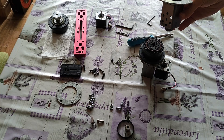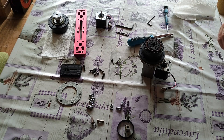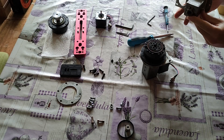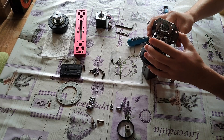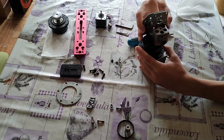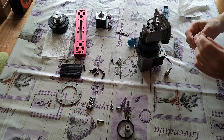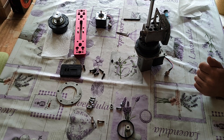I've got the declination axis here and the six holes will line up with the holes on the harmonic drives and I'm going to screw those in now. The first screws are most difficult to put in but once that's in the others are easy. The first screw is already in. I would usually use a 4mm allen key but I've got the screwdriver and it's just easier to fit in the holes for the rest of these screws.